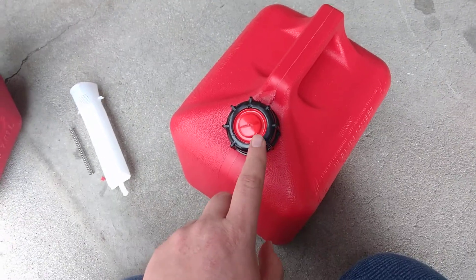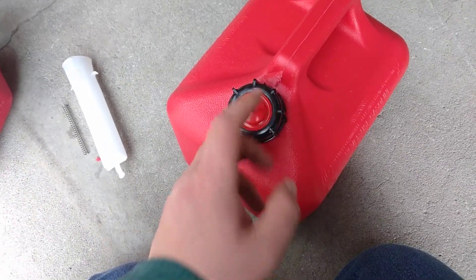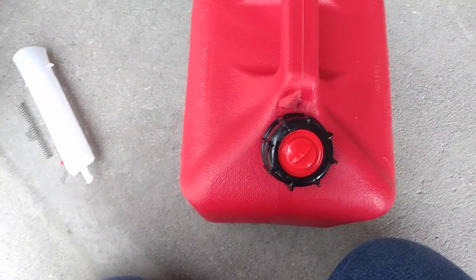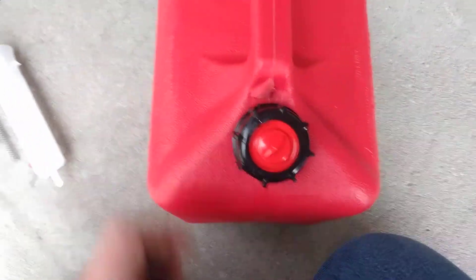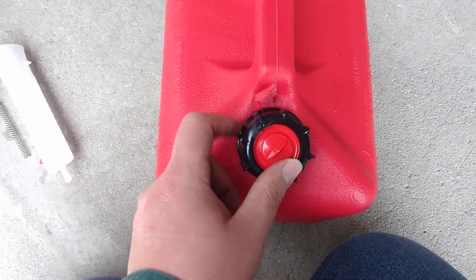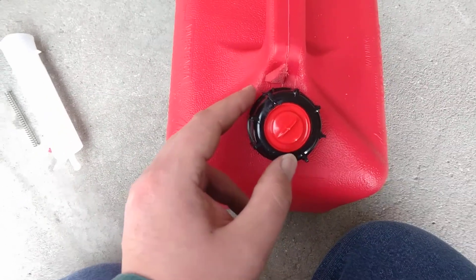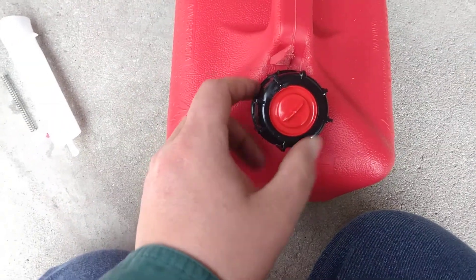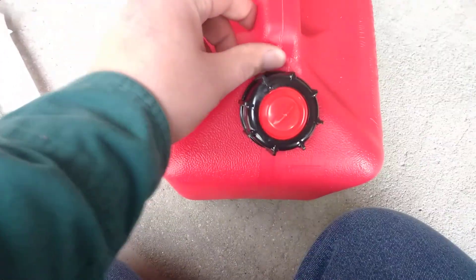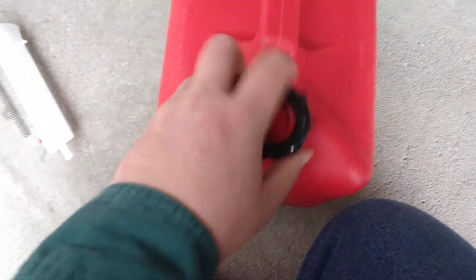Anyway, I made this just like the old gas can and I'll give a brief explanation on how I did that. When you first buy this, you can see there's a triangular profile here. There used to be a notch there that would act like a ratchet against a gear-like thing on the cap. What I did was I cut the gear thing off the cap so it's no longer there, and I filed down this triangular profile so now it doesn't interfere with the operation of the lid — it just opens really easy, just as a normal gas can should.